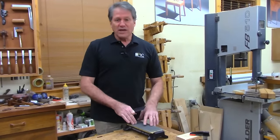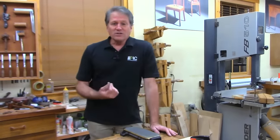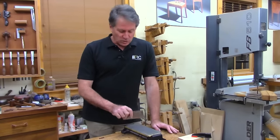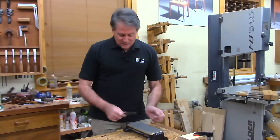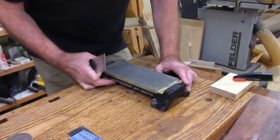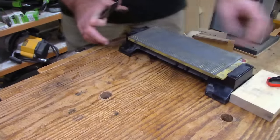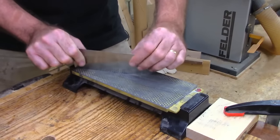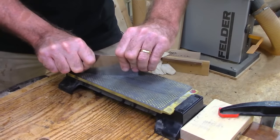It's a good idea to do this next step: honing on a plate. This is where having a diamond plate is hugely valuable. I used to sharpen them on regular water stones, but water stones are fairly soft and they will dish out and you can get a groove in them. The diamond stone is dead flat and it's hard so it doesn't go out of shape. I'm going to start with the red side — this is the Duo Sharp plate, the four-by-ten. I'm going to set this on edge and bend it so that it sits at about a 90-degree angle to the plate.